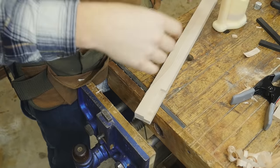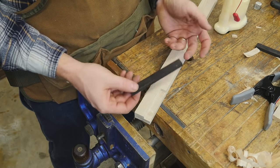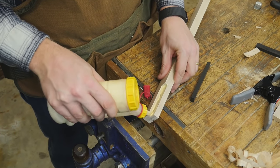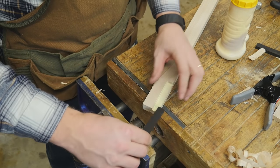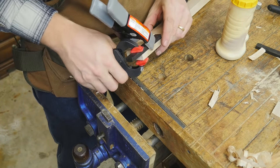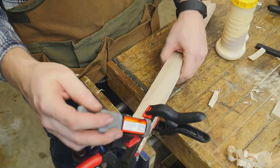Next, it's a simple matter of glue-up. For most woods it's not a huge issue, but with ebony it's a bit oily — some people like to wipe it down with alcohol first, but for something like this that's not going to be under stress, I just actually glue it. I want to make a lot of squeeze-out because I'm going to be planing them all down — it'll be nice and smooth afterwards. I just want to make sure the glue is all the way back into the corner. Slide it into place, and I'm going to come in with two squeeze clamps to hold it down. These squeeze clamps make perfect use for this little thing. I'm just going to set that aside, glue up the others, and get back once it's dry.